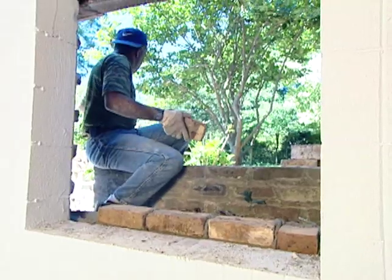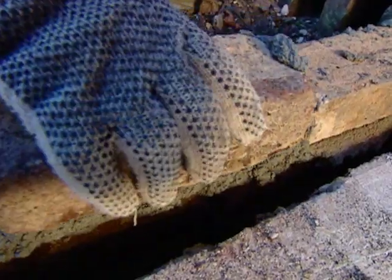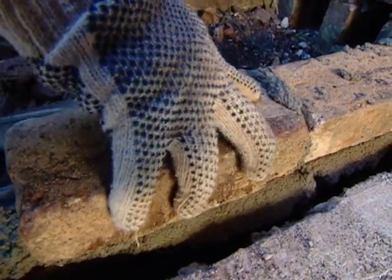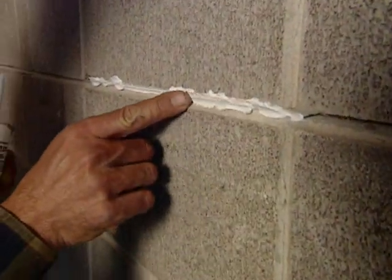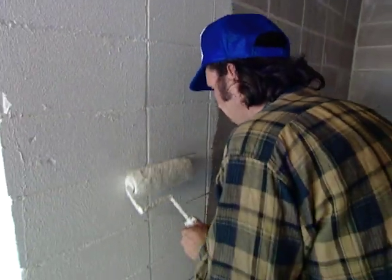Okay. Well, I know the brick mason did a good job both on the bricks on the outside and the blocks on the inside to really give a good tight sealer of that, but that wasn't enough to keep the water out. Tell us about the waterproofing. Well, what we've done is we've inspected all the area and we looked for any possible holes or cracks that's originally in the block itself. We used a mortar caulk that is available to seal all the cracks and do the patching. And basically then we've applied 2 coats of sealer. You can only apply 1 coat per day. It's a 12-hour recoat time. And we put 1 coat on, and the following day we put on the next coat.